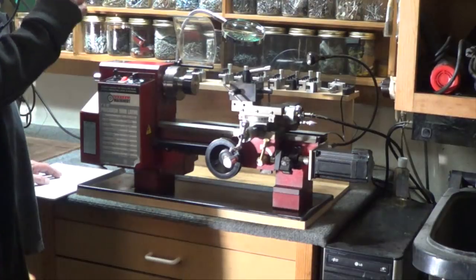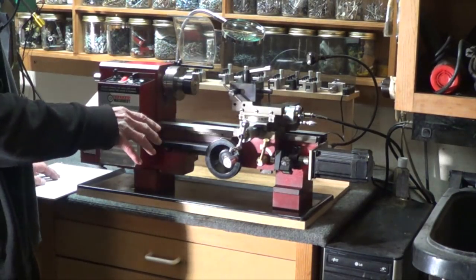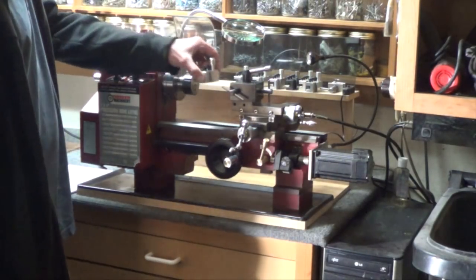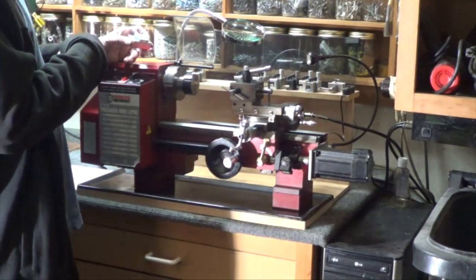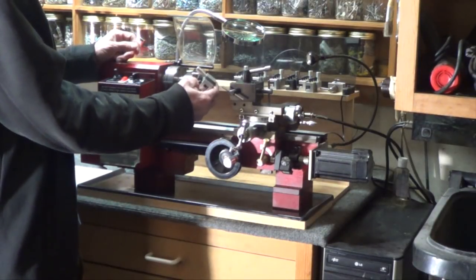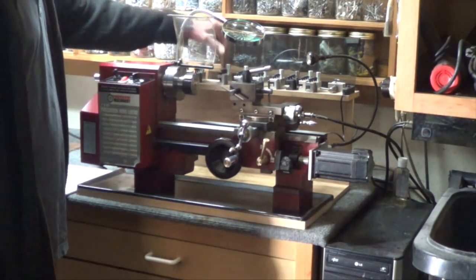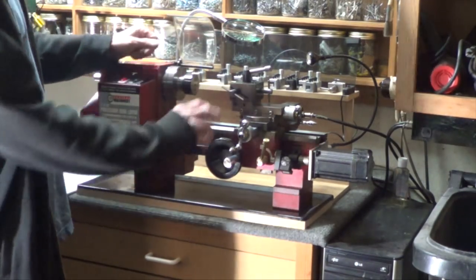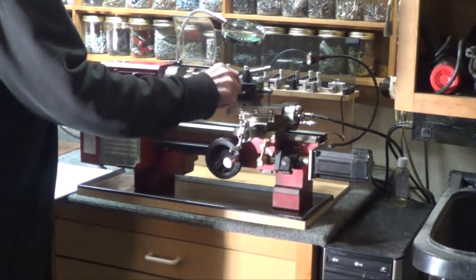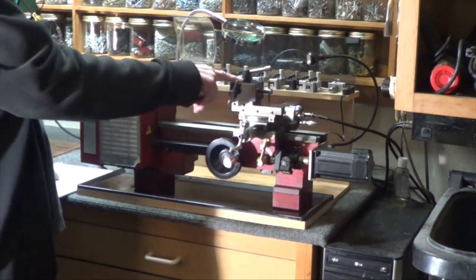So: number one compound, two vibrations, three the quick change tool post — forget the old way. Going to the quick change tool post is so easy to get heights. You're not going to play with shimming cutters. Now you just drop it in, tighten it down, go. Change it, tighten it down, go. Playing with that stock tool holder is a joke.